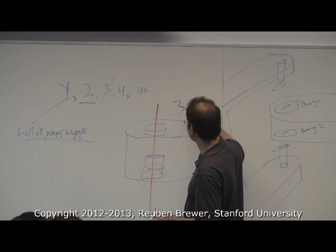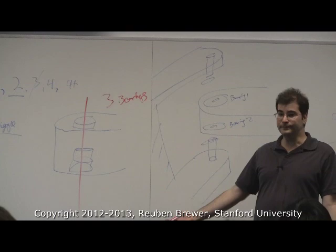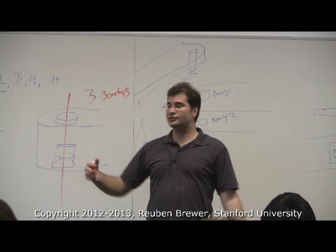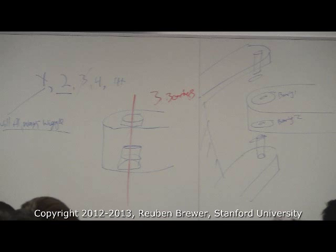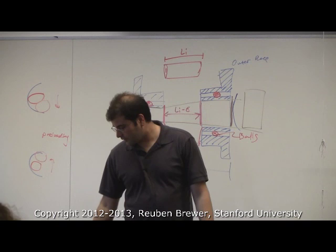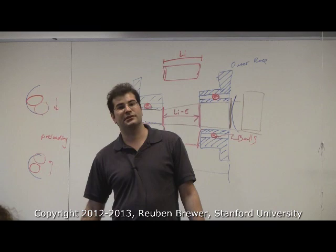It's over-constrained. If you are worried that two bearings can't handle the loads, then change the loading schematic. Separate the bearings or get bigger bearings or do something other than over-constraining the problem. That's like saying, okay, well, my table, I've eaten too much parfait today, and so this is going to break if I sit on it. So I'm just going to start crazy gluing 20 legs on it. That's a bad idea. It's already over-constrained with four, and adding 20 more legs is just going to make the over-constraining worse. So just give it beefier legs, or put me on a diet, one of the two.